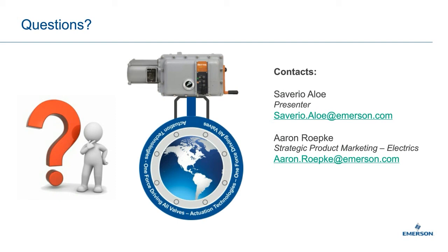Has the M2CP undergone any vibration testing? Yes — we have done vibration testing to military standard, specifically for Navy qualification, and that information is available for anyone interested. Regarding special materials for coker applications compared to conventional actuators: the standard materials used in M2CP construction are suitable for coker applications, both for temperature and corrosion resistance. We also offer a three-coat ceramic coating for the actuator if additional corrosion resistance is required.